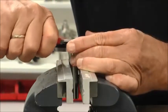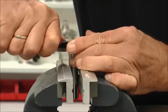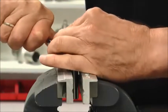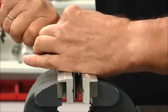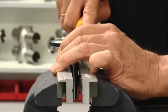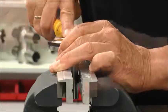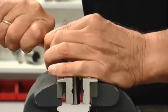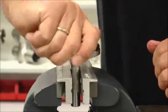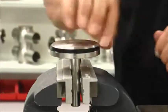With a seat insertion tool, such as a flat screwdriver that has had its sharp edges rounded, start in one location applying force to the seat to help the seal drop into the groove, as shown here. Install small sections of the seat at a time, moving to different locations periodically to ensure even installation of the seal. Check the correct fit of the seal after the installation.